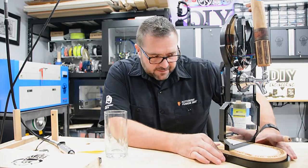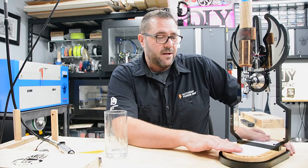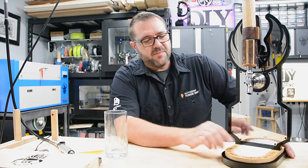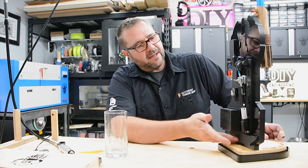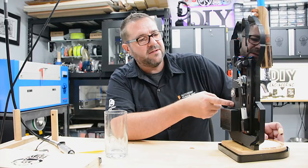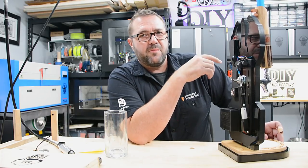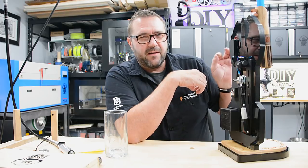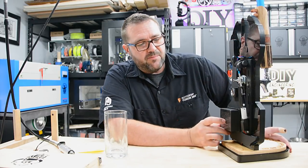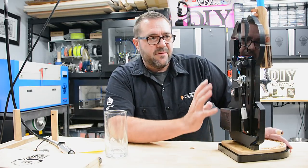Let's spin it around and talk about some of the technical aspects of it. If you look at this base, it's got a white Delrin Rebel Force logo laser cut into the front, and then it's got laser engraved saying 'do or do not, there is no try' in the bottom. All the wires from those components, along with the RGB ring, come through the back and up through the backside. This irregular shape is basically a wiring harness and wiring loom. The wires all come up between the layers of the laser cut foam core and go up to this module here, which is where the force is detected. We're using a GridEye 64-pixel component that can read infrared — basically like a little mini FLIR module — and we use that information to determine what the force is for dispensing the beer. This box right here is 3D printed, laser engraved, and this is where the Photon lives along with the motor driver, MP3 player, and other things necessary to make this all come together.